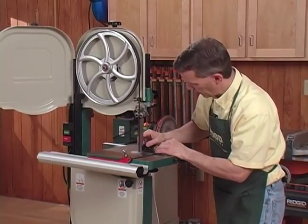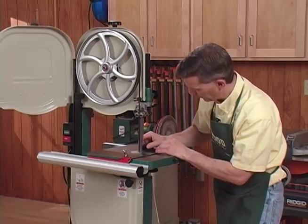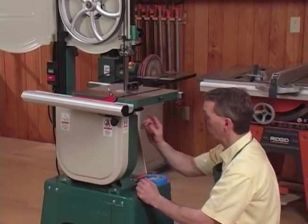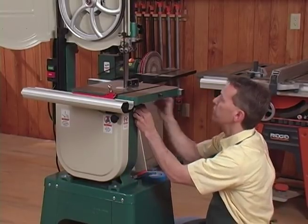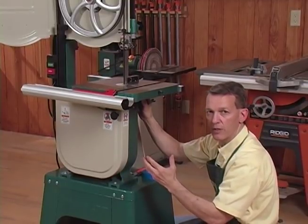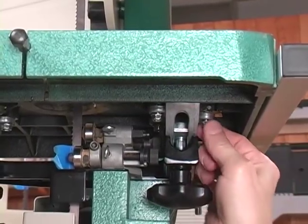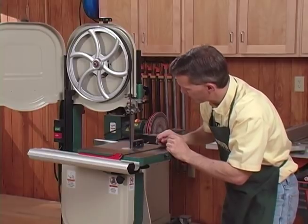The final check is the blade square from the back of the blade to the table. This one is also off just a little bit. There's no adjustment built into the saw for this, but it's an easy fix nonetheless. Down below the table, there's a set of bolts that hold the trunnion into the table — loosen those up. Then insert some shims between the table and the trunnion. You can use brass shim stock for this, you can cut your own out of old pop cans, or even if you need micro adjustments, use a couple layers of masking tape. Once those are in place, tighten the bolt back up, check your square, and that's exactly where we want to be.